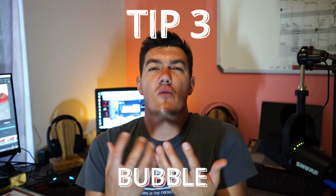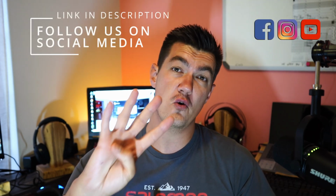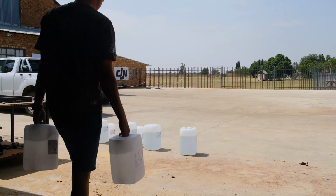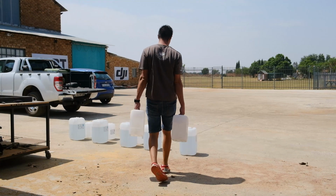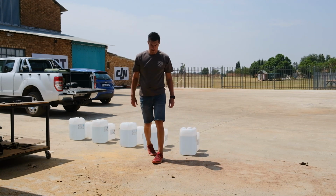air bubbles. The one question we get so much from all the people that's watching our videos is, how do we deal with air bubbles? Very easy. This section I'm going to divide into 4 quick tips. Number 1, before we start planning and mixing and pouring our table, we would put our part A and our part B resin and hardener in the sun for around about 2 to 3 hours to heat up the epoxy.